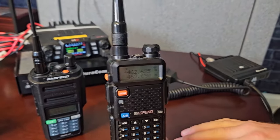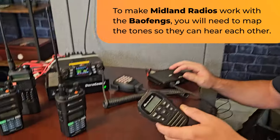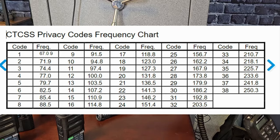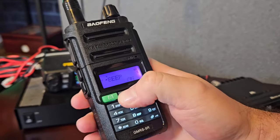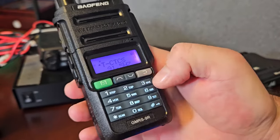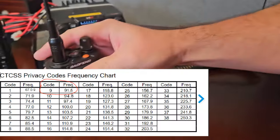There's really no purpose to the UV5R if you have your GMRS license, and these are ham only — you shouldn't be transmitting on ham if you have a GMRS license. One thing to talk about: this is a Midland radio, and we're going to flash on screen the tones and how to connect the Baofengs to the Midlands with your privacy tones. The privacy tones are coded as numbers on the Midland screen — this is 9 on this screen.